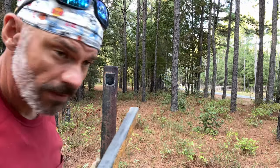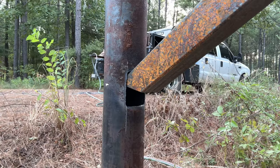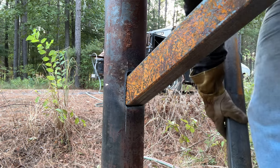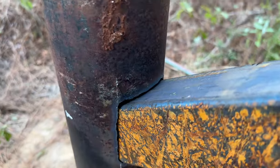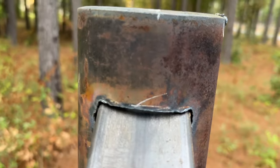Okay, I think I can weld that. We're going to slide the top in as far as it'll go, then I'll move the camera for you. Alright, that's what I'm left with — looks like that and it shouldn't be bad either. So like I said guys, if you know a better way to do this, it's pretty easy, that didn't take very long. But it keeps me from having to saddle square tubing to go on pipe on a certain degree, and this is the way I like to do it anyway. Usually I don't do it to four inch — it's much easier to cut holes in six inch and stuff like that. When you get to four inch and three inch, it starts to really get a bend to it, it's a little bit harder.